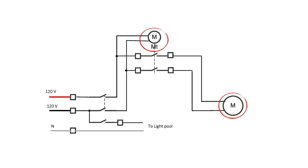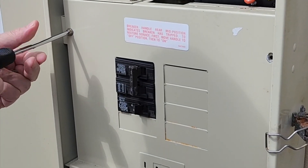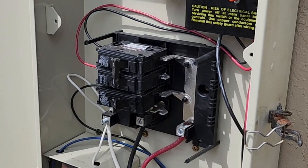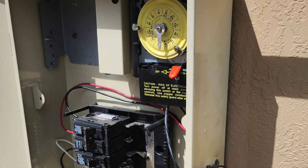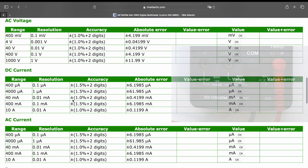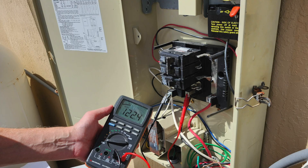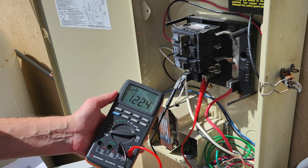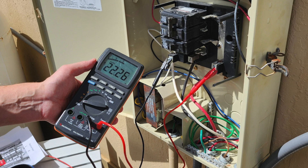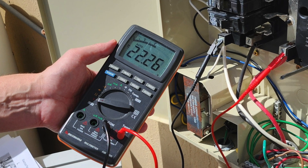This means that it is necessary to check the voltage lines of the control electrical panel. We remove the cover and inspect the pool pump electrical control panel. In it we see breakers for two phases, and on one of the phases a breaker for pool lighting is connected. Both the electric timer and the motor do not work. For testing we use our advanced multimeter Octacom AM1060. We connect the multimeter to one phase and see 122 volts — this is correct. We connect the AM1060 to the second phase and see only 22 volts. This is something unusual — why 22 volts, and where does it come from?